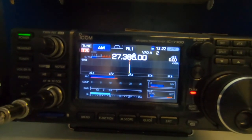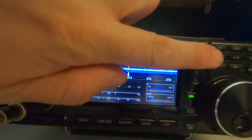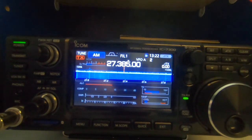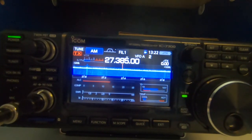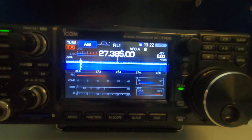As you can see, we don't even have any reflected power — we're not even a bar on this SWR meter. Let's see if we have power going out: we're at 92% output of 100 watts. That's a pretty good baseline to measure SWR with, at high power — at least 100 watts or close to it going into the antenna.